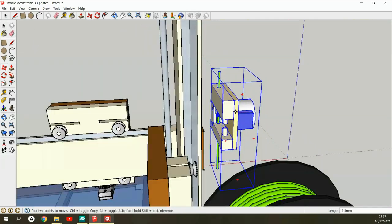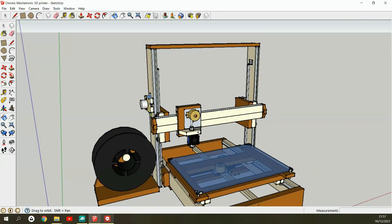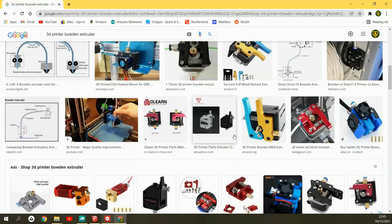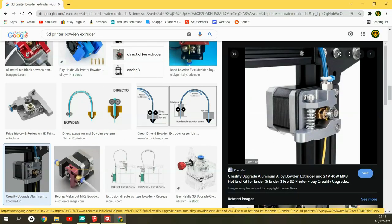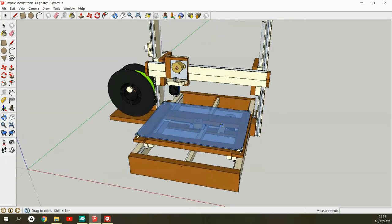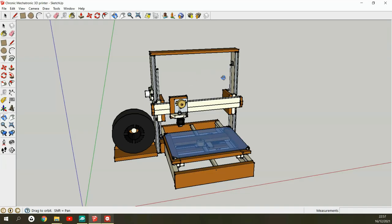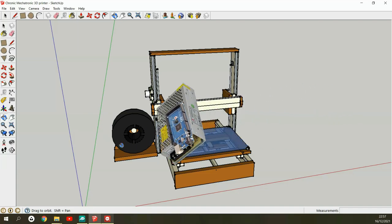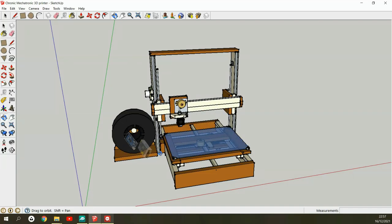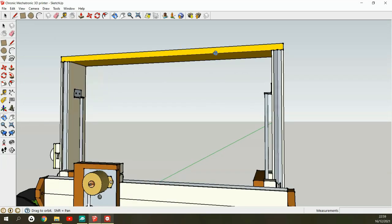I actually really like this placement — it's very accessible and efficient, and doesn't add much mass because it's so tiny compared to the huge extruders on other 3D printers. The heated bed is going to sit on 4 springs as usual. It's really not a tiny printer at 33 x 24 x 24 cm print volume. I haven't sketched out the enclosure for the electronics yet, but it'll be attached on the left, doubling up as a filament spool holder. As of right now, I don't plan on painting it because that messes up clearances. However, it will get a couple of rainbow RGB LEDs, even though that might make it look like gaming equipment.